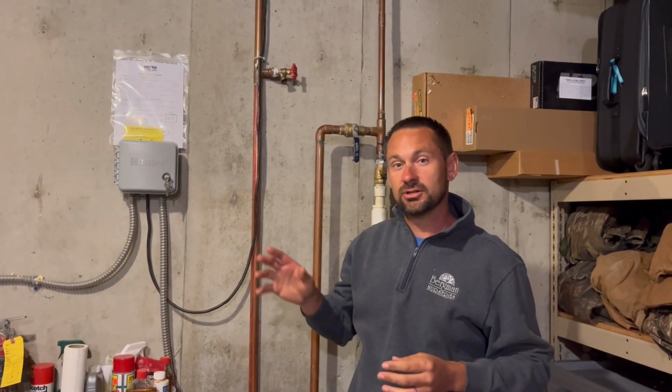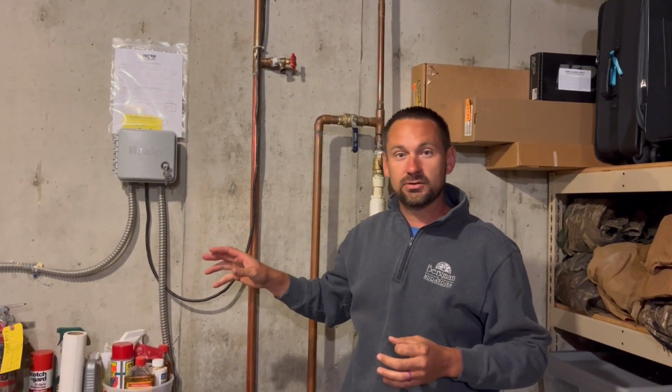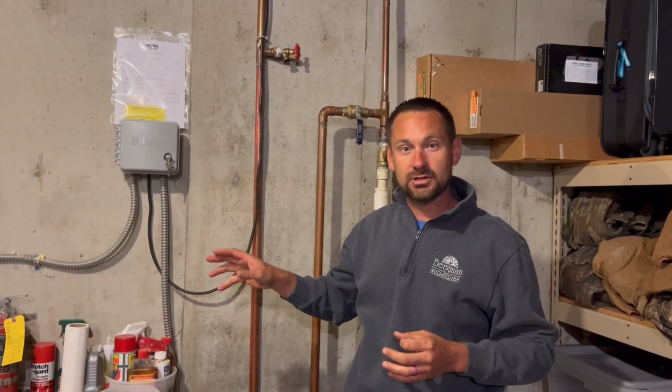And that's really it. So that will take care of a Wilkins backflow. You're protected. So the only thing you would have is still your irrigation meter. If it's in the ground, pile some stuff, blankets over top of that. Just don't let that freeze. Make sure your controller is off, especially if you have a pump.